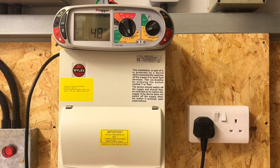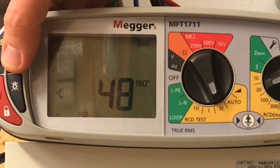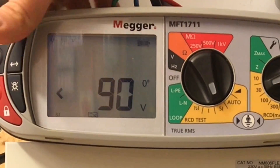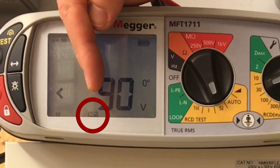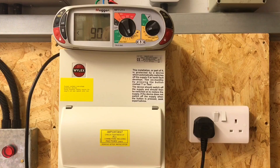Now we're going to repeat the five tests, but we've got to repeat it with the machine set as if it's looking at an A-Type RCD. So what we're going to do is do a long press on the button here, and that's going to change the device type for the meter. Now that's gone from AC type - you can see the icon has moved over and we've got the symbol for an A-Type RCBO now. That means we can go through the process of doing half, one, and five times to complete five more tests and record those readings. Then we'll pick the reading we're actually going to record in our test paperwork.